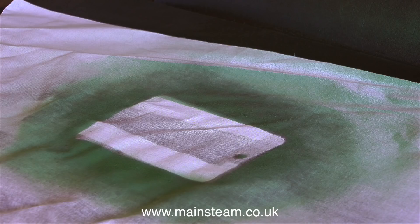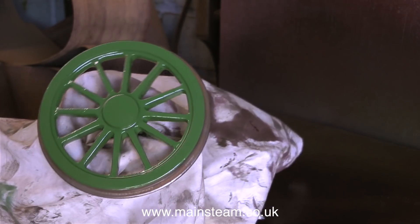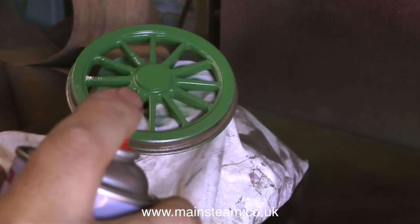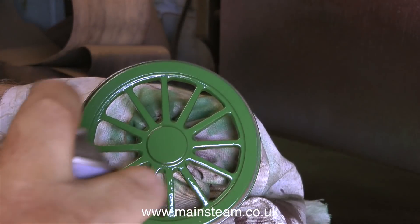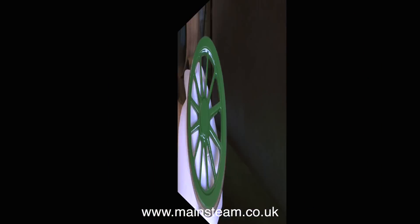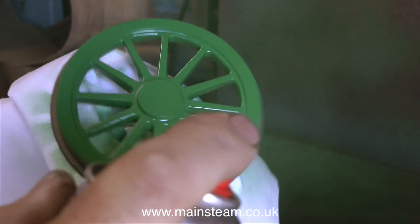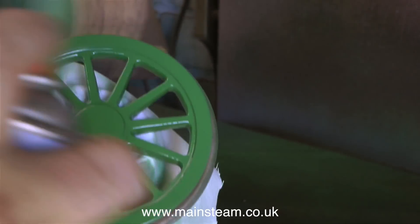Using a piece of prepared brass plate, I'm going to show and use various etched primers, then put the same top coat on all of them to see how well it sticks. Here are the front wheels of the Stirling Single - I painted these using a brush in the last episode. Now with an aerosol spray can full of Great Northern Railway green, I'm spraying on the top coat. No masking required, I'm just holding the parts with a cloth and only spraying one side of the wheel at a time. That way I can place the wheel upright for the paint to dry and there's no chance of the paint running.